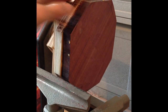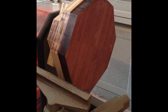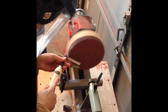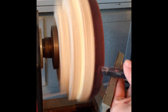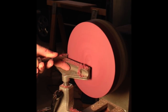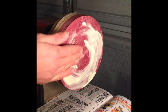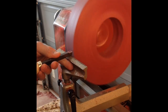I glued the bottom layer of the bowl to three pieces of plywood so that I can attach the faceplate without damaging the bottom of the bowl. Now I'm going to turn it around so that it's more steady and then glue on the next ring. I found the best way to do this was using my square carbide cutter - use the corner and take off the material that way. Now what I'm doing is flattening out the face of the bottom ring so that I can attach the next one. I found the best way to put glue on was just with my hands, smearing it around. For clamping I used the tailstock to push pressure against the ring and then clamped it together. Then I could true up the blank.